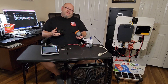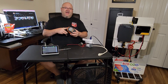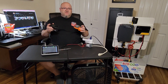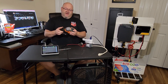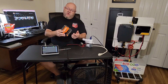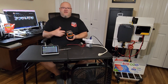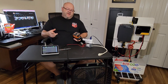This company is owned by TTI - they make Ryobi, they make Milwaukee, and some other tools as well. If you're looking for tools where you don't have to keep buying batteries, Ridgid is the way to go. But I want to talk about this inverter. This is a 175-watt power inverter that hooks to an 18-volt battery, and it is a modified or stepped sine wave - not very clean power. A lot of people ask why it's important to have a pure sine wave inverter, and I'm going to show you in just a second.